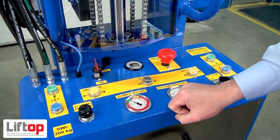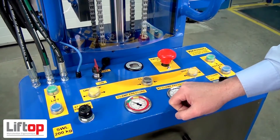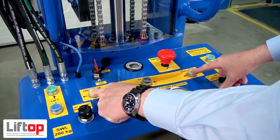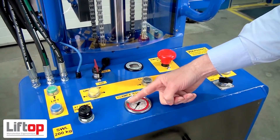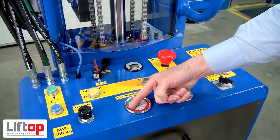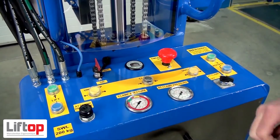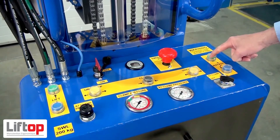To unclamp a roll, the roll must be on the floor — it must not be raised. To unclamp, we press two buttons at the same time marked unclamp. Keep them pressed until the gauge comes all the way down to zero. Then we have lift and lower controls, and over this side we have rotate forward and back.